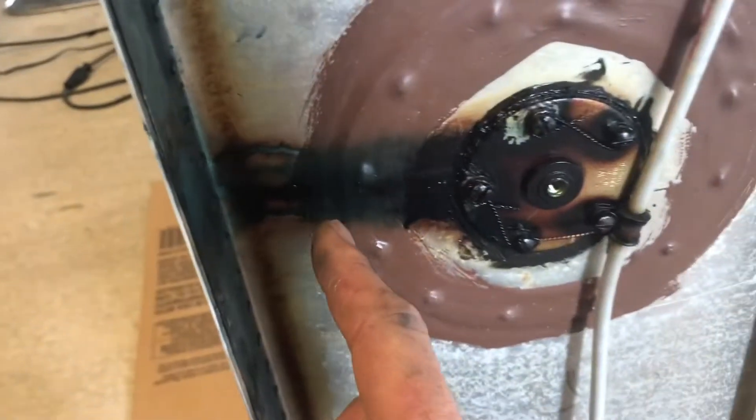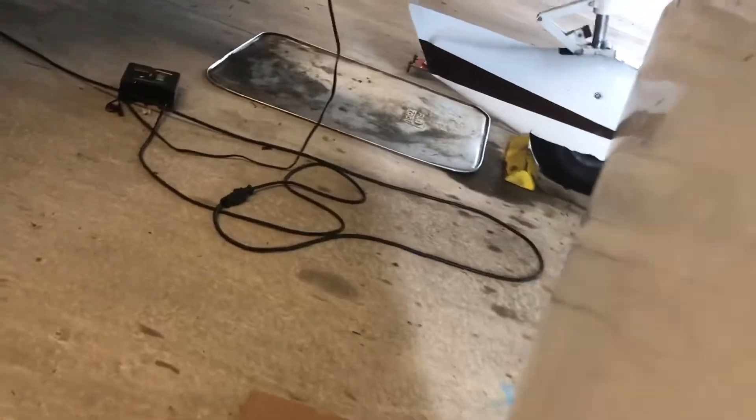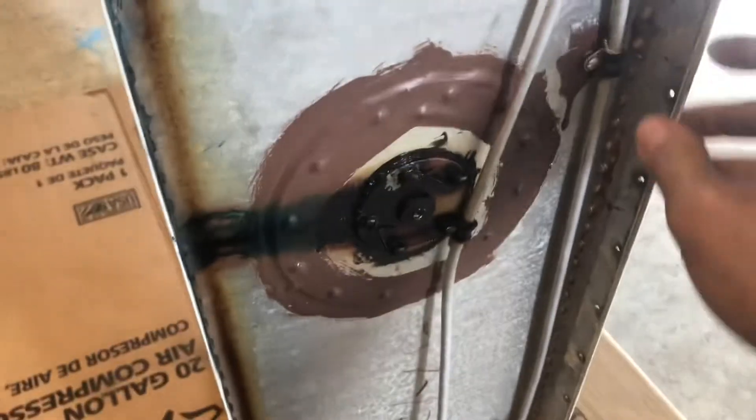Then you can shift focus to the tank itself. Inspecting the fuel line, look for evidence of fuel stains — hopefully everything is intact. The fuel sender was leaking, not a lot, but enough to see on the outside, which is the main reason this tank was pulled in addition to complying with the service bulletin. So we're going to replace these lines, put a new gasket on the sender, replace the vent line on the side of the tank by the filler, replace all those soft brittle rubber hoses, replace the sender gasket, and replace the main feed line.